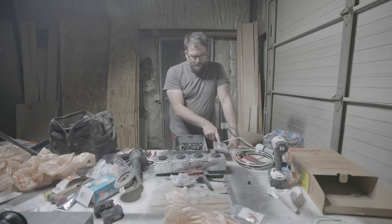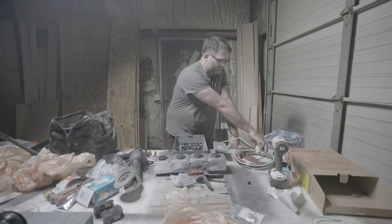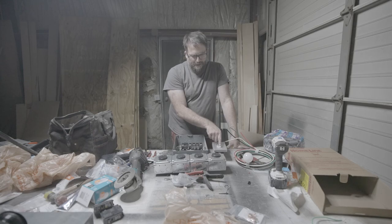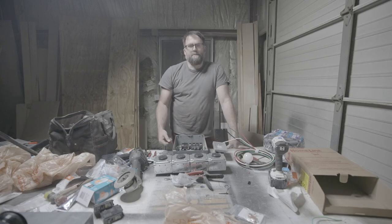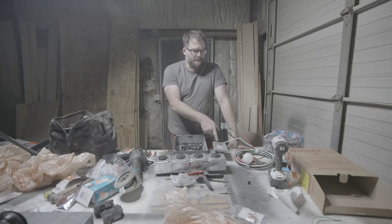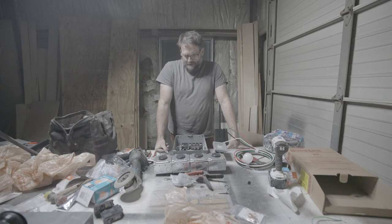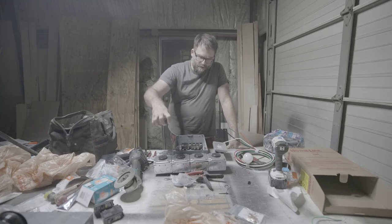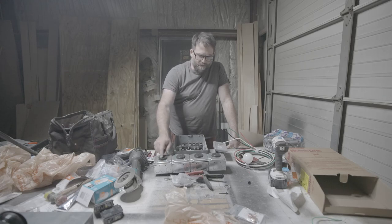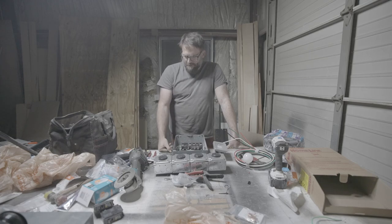We also have a little indicator light. This is going to be connected to the output of one of these 20-amp circuits here — simply to a light bulb. The idea is that this pilot light is on whenever the system is energized, whenever any of these breakers are energized. This light switch is just a courtesy light — so if someone's reaching in here to plug stuff in in the dark and the generator's loud and it's sort of chaotic, you can at least see the pilot light and flip the light switch on and your entire bay is going to be lit up. We're back-feeding this panel in, so the two legs are coming into this master 50-amp disconnect, and we're going to have isolated earth and neutrals. We probably do need to put a bonding screw in this.